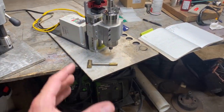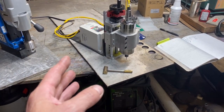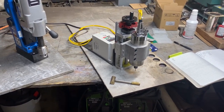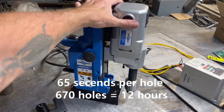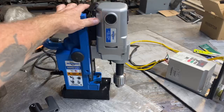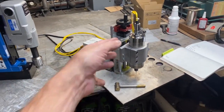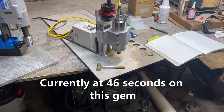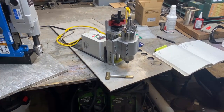I need to practice before I get into the job because I can't be breaking off drill bits in these holes — I'd have to build an EDM machine if I do that, and I don't want to build an EDM machine. This is a really nice drill, like a $1,400 drill. But it's only fast at drilling really big holes. I've seen CNC machines drill holes through metal this thick in like five seconds flat, but those bits had fluid coolant holes going through them.